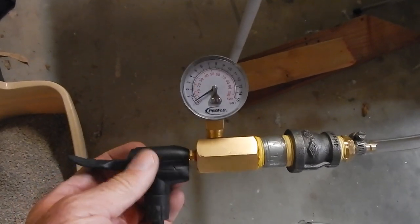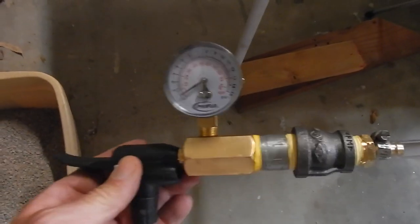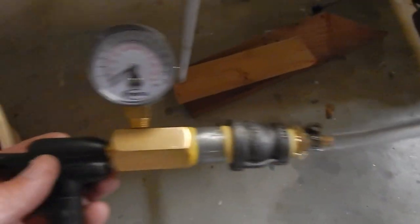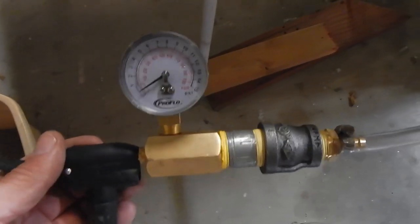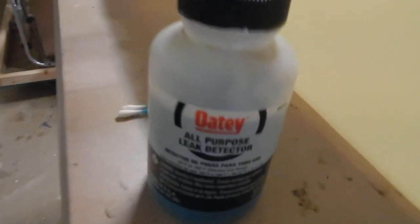We use this for gas pressure test, so it's a low PSI. I bought a little additional hardware at Home Depot to convert this to a tube. Clamped on the tube, got it on here. I'll put a couple pounds in there, make sure my tank doesn't inflate. And with gas, we leave them in there for a day. So I may test with the bubble test.